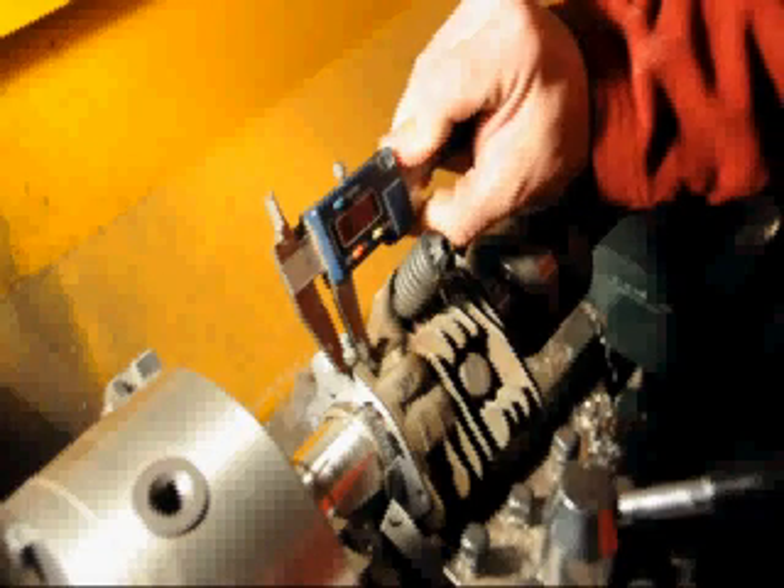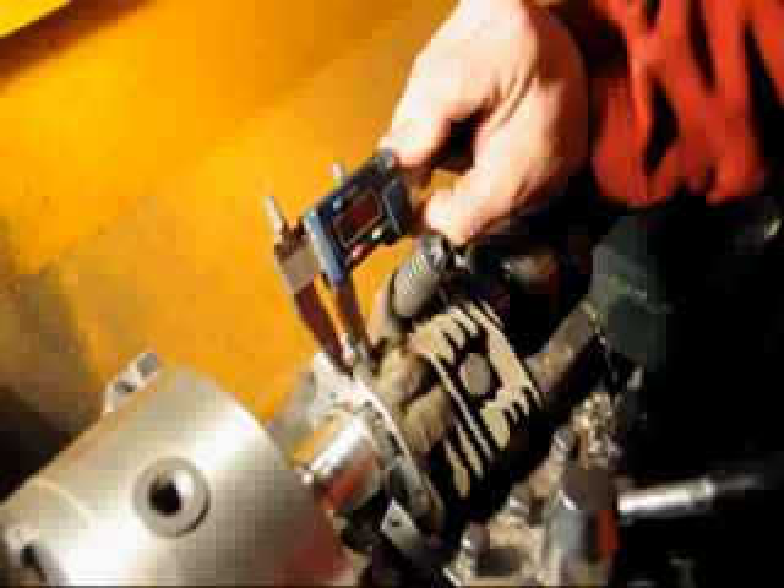The base is finished out nicely to 0.275 inches. Lastly, we're going to trim 0.050 off of the flange. Quite often that gets missed and it rides up against part of the base, holding the cylinder away from the base of the engine and causing an air leak, or causing the ears to break off the cylinder.